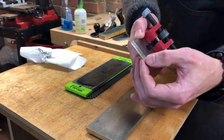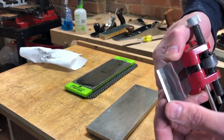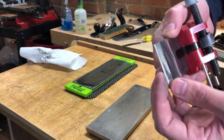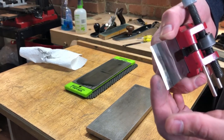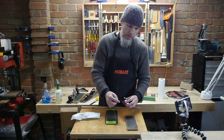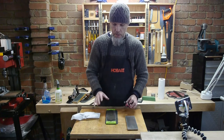Now it's actually broken off. Here you go, this is what I was talking about. It's a thin wire. So this is the real sign of the actual sharpening process at work. Ideally, this is what you need to get. So effectively now we can tell that the sharpening has gone all the way across the edge, and we've used the 1200 grit.